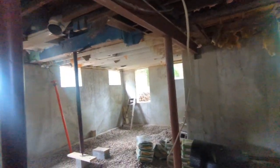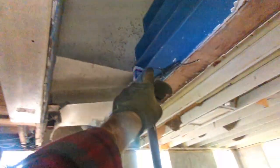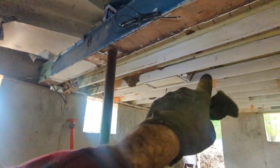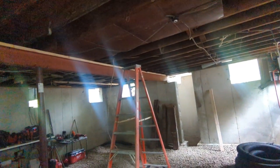This 2x6 could come off the ceiling here. Just some things that weren't pressing issues or weren't worth addressing when we were in the old basement, that we will address now. We'll get this board situation off. We'll uncover and open this up over here. We'll get the U-head on that shore over there. We're going to just start with this type of stuff and make sure that we get all of it correct,